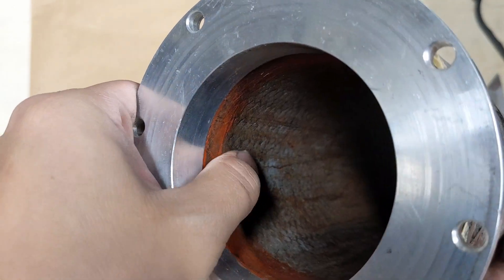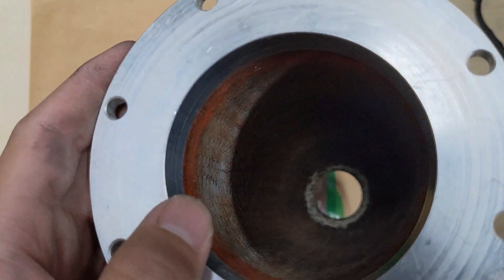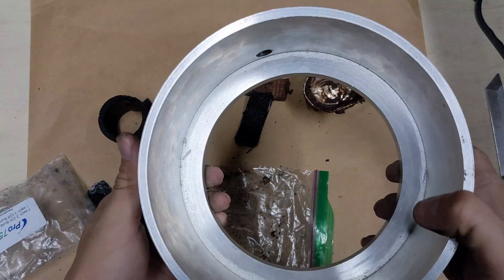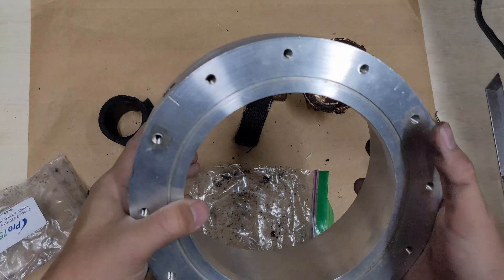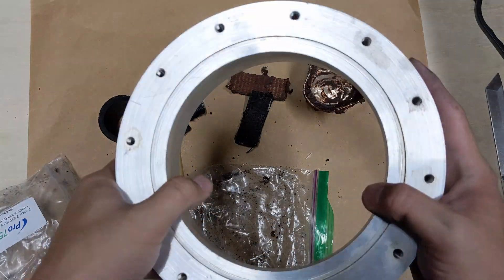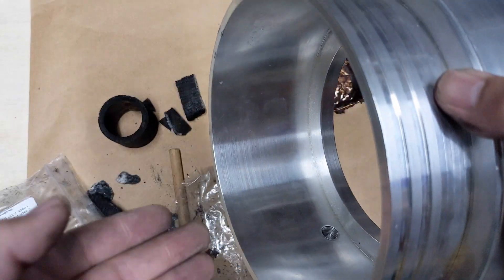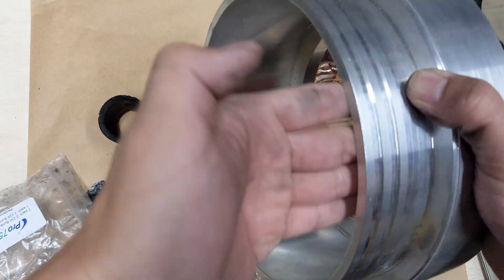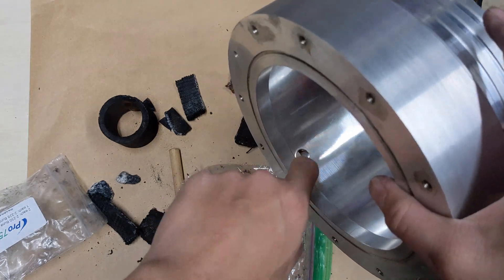The woven tube sleeve used here provides a nice clear seamless contour to the very bottom. Hopefully it performs well but I haven't tested yet. If you're curious about how scalable the flange and composite ablative liner is, here is a discarded flange for an old Garvey 5000-pound engine — really big. The carbon fiber can grip onto the edges on the outside like this; your silica phenolic composite ablative liner slides in here. You can place your chamber pressure transducer through here and through your chamber.